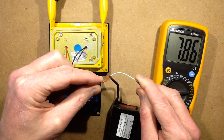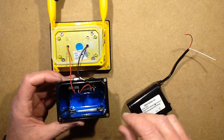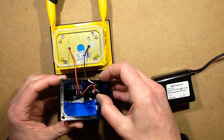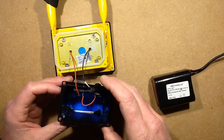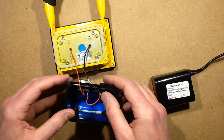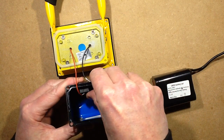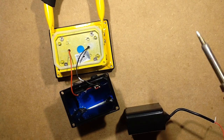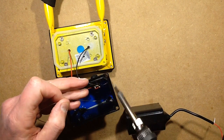Red is positive — that's nice. Excellent. So what I'm going to do now is bend these terminals back because there's no way I can get the battery down here without bending those things out of the way. I'm also going to have to bend this lead back, so I'm going to have to take the connections off and squish things a bit. I'm going to have to de-solder these completely, just to make as much space as possible and fold them back as close to the switch as possible to allow the cell to go into the pack. Let's remove that connection completely.